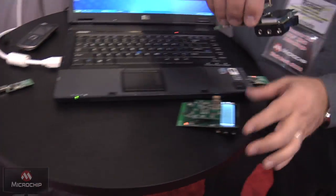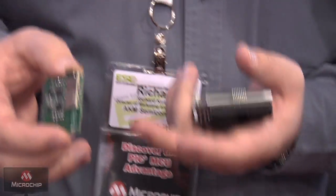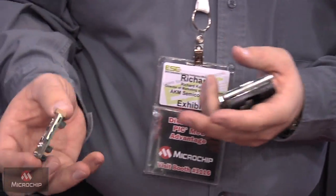The way the system is done modularly is the top of the boards come off, exposing the PIC24FJ. The top boards have the capability of being just an accelerometer and compass, being an accelerometer, compass, and gyros, or being an accelerometer, compass, and GPS. Just about any version of the top board can be made or is available to you, and it just allows your customers to pick what they want to do from a navigation standpoint.